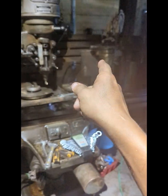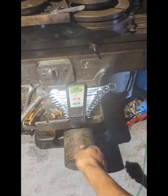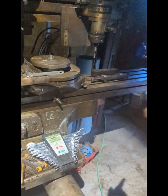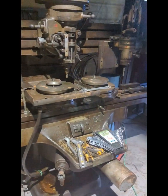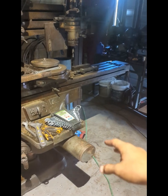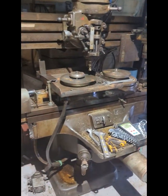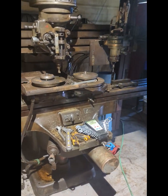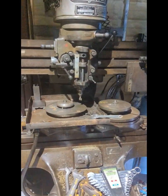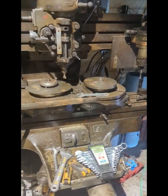The issue is that typically there would be a hand wheel here, but instead it's just a hydraulic cylinder, and another hydraulic cylinder over there — hydraulic cylinders everywhere. It also came with a huge hydraulic pump and a bunch of other machines, cooling systems, et cetera. The hydraulic pump was almost 3 horsepower, while the spindle was only 1 horsepower. The hydraulic system to control all this is a beast.